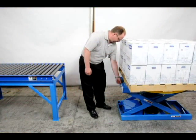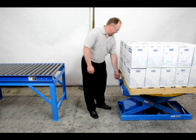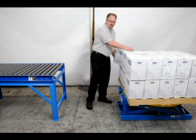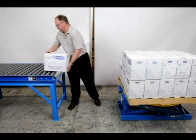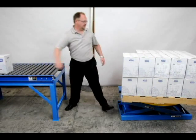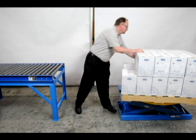Alternatively, you may place a load on the unit and simply bleed the air down to a setting that begins movement when a package is removed. This is an example of the self-leveling palletizer in use for a destacking operation. Ergonomic lifting, of course, is extremely important for both worker efficiency and safety.